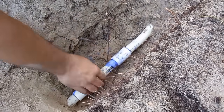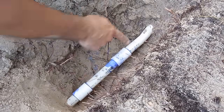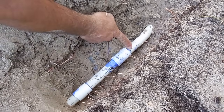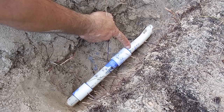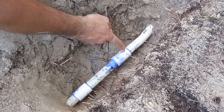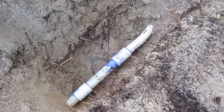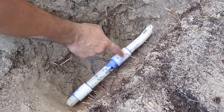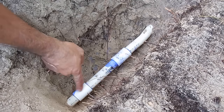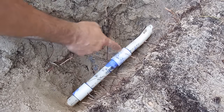This right now has had time to set and it's all one piece. Right over there is my blue mark where I made it with the pen, so I know the coupling is exactly where I wanted it — halfway onto this pipe and halfway onto the one that was broken. So your break was right here, which you repaired, but you had to go a little further back with another coupling to be able to get rid of all of the damaged area.